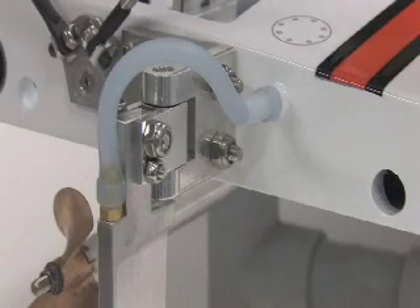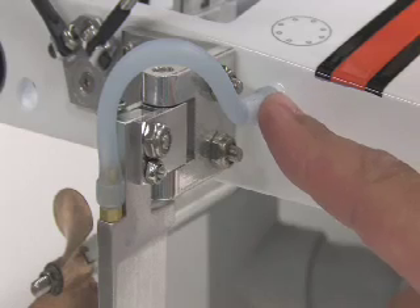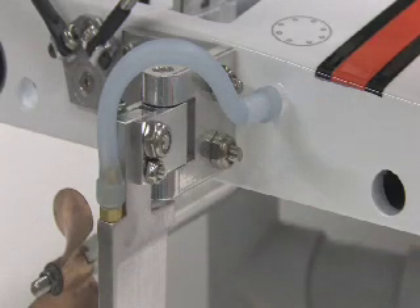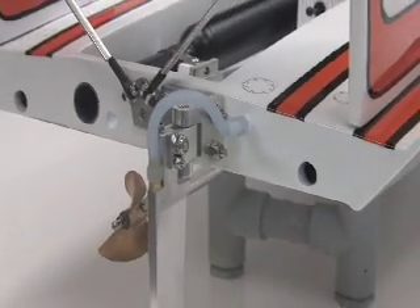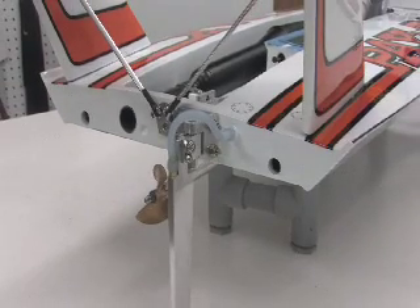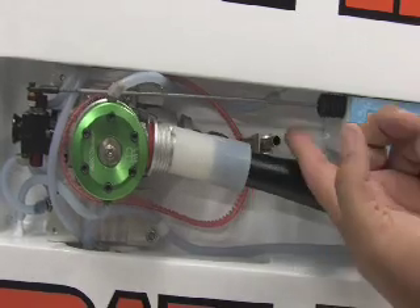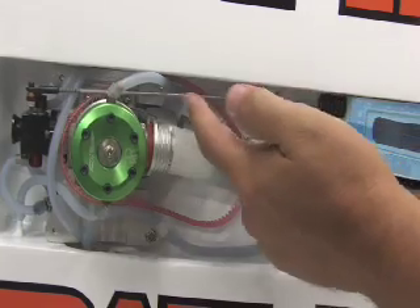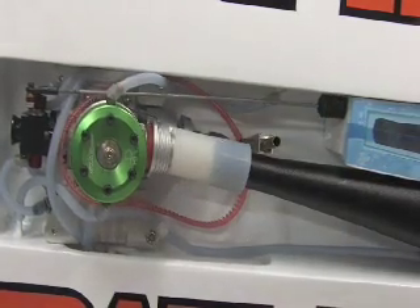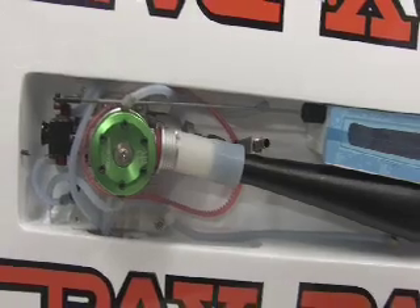Here's a view from the other side. Earlier I talked to you about the brass water line that I install in the boat when I sell my hulls, and this is the brass line right here which actually goes through the hull. It's mounted permanently in there so you don't have any silicone tubing inside the engine well. It comes out right here and I take silicone tubing and run it right up to the engine for the coolant. So this is the water coming from the rudder to the engine, and then I have an exit which comes out here.